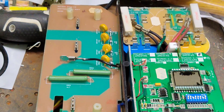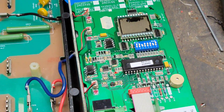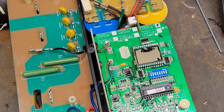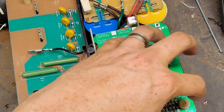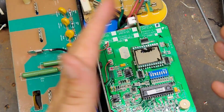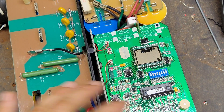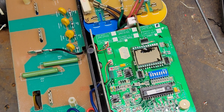It only uses power from one transformer and usually one or two capacitors all the time. As soon as it feels it needs more firepower, it'll pull in more capacitors and pull on that second transformer to shock the fence harder. As soon as it detects it's not as stressed, the joules fall back down. We don't get these in very often. They can't always be fixed — if the board has a software problem you can't get these main boards anymore. You can't get the top board or the bottom board. You also can't easily get the transformers, so we retrofit our own transformers into these.